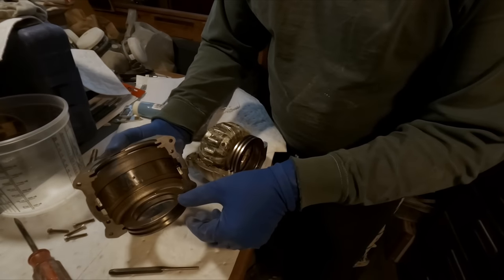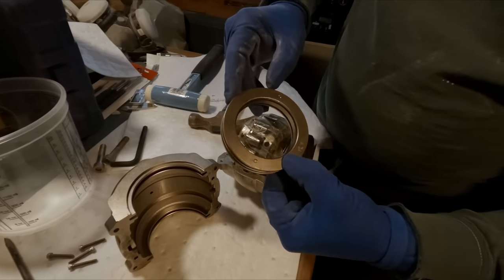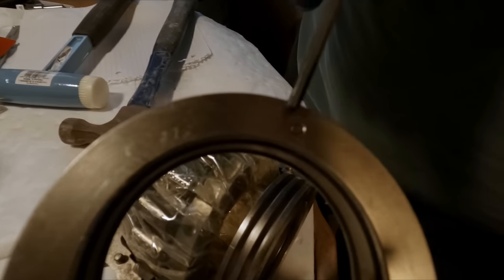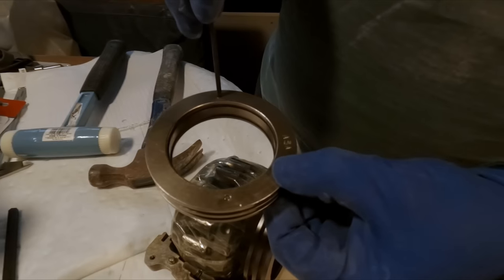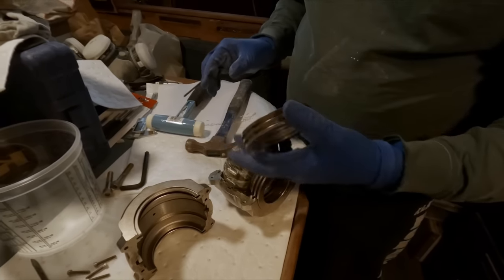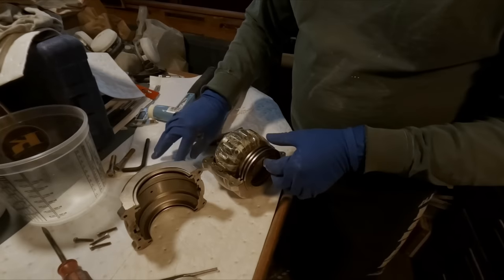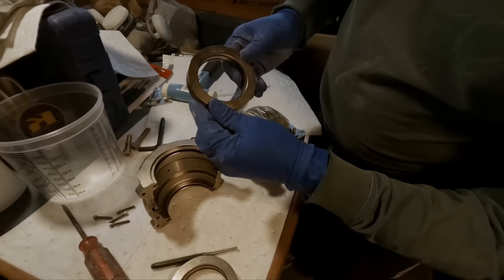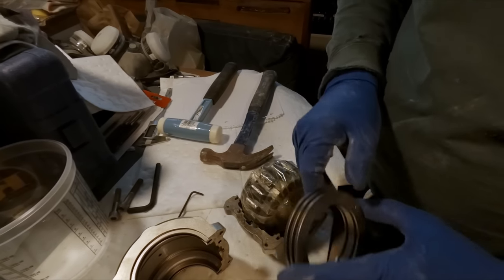We just separate those two halves. This is a seal right here with two o-rings — it's just pinned together. It's kind of hard to see the part line, but there's a tiny little part line right there. These are held in by two pins. Just drive those out with a small pin punch, and they'll go on the shaft. You squeeze them back together and put the pins back in. The orientation doesn't matter side to side, but you do have to make sure that 'Cooper' is facing out.